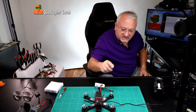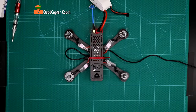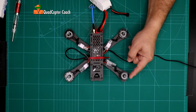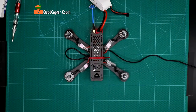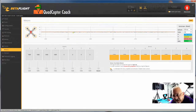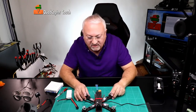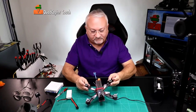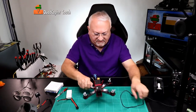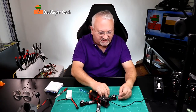I'm going to go to number four, which is this motor right there. Spinning it up very slowly — I can put my finger by that tape and feel it is spinning in the correct direction, which is perfect. Excellent. I'm going to turn that off and disable the motors, and I can disconnect the battery now. At this point we know the motors all work and which direction they're spinning. Disconnect the USB cable and take the tape off the motors — we're done with that for now.